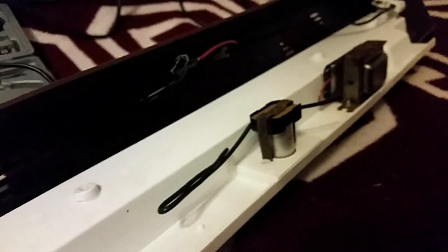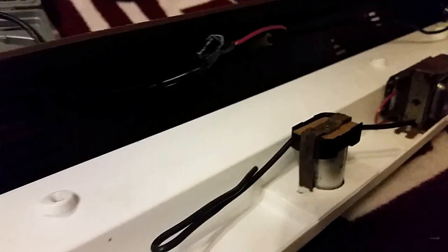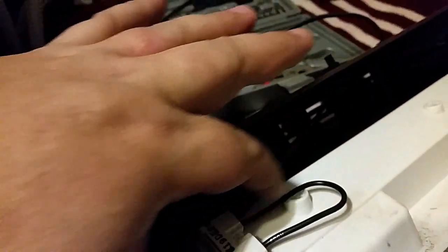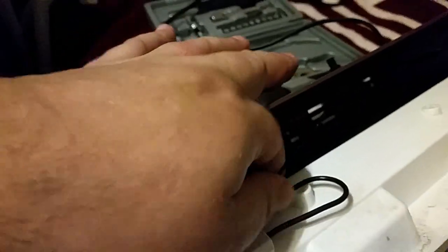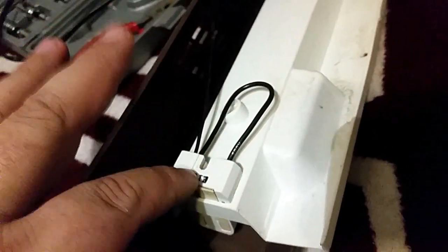The only thing is, once you've got it on, you've got to redo your wires. You just cut the wires off your ballast and your starter, flatten them off, take the positive from one, run it to one end, and circle around here too as well, so it gets to both pegs inside here. These tubes have 2 ends, 1, 2 on each end, so you run it around like this so you can get it on both sides. And then it runs through the bulb down to the other one. You do the same with that one, only you run the negative down to the other end.